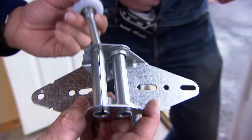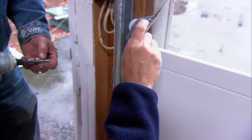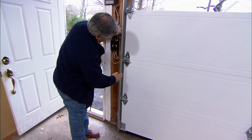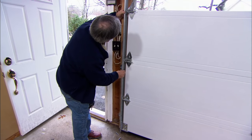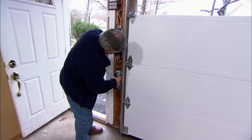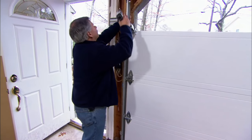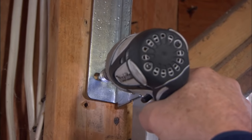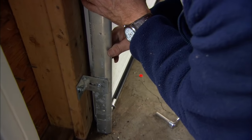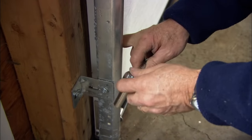On this end of the door I didn't put the hinge or the roller on — the reason is we wouldn't be able to get the door into the opening. So now we can just roll it into the track, position it, and screw it off. I want to make the track parallel with the edge of the door, so I'll eyeball it so the space is equal. Tighten up my lag screw, and put one up at the top. With this nut loose I can slide the track in or out — I push it in a little and pull it out just a hair. I don't want it to touch because I don't want to create any friction when the door opens and closes.